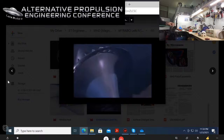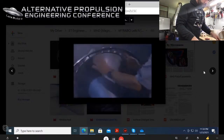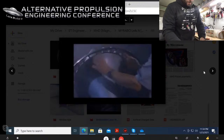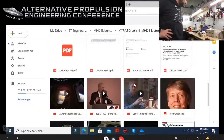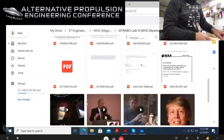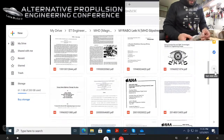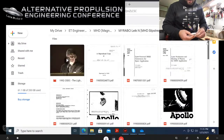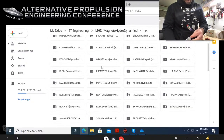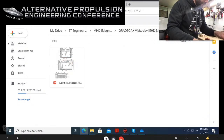Jeremiah, what would you recommend for a spark gap distance? What's your discharge potential? I'd start out at about 1 millimeter, and I'd open it up from there up to about a maximum of 5 millimeters. Okay. Should I also throw in some resistors between the power supply? Between the power supply, yes, definitely. Just in case the rectifier happens to have a problem and it bypasses, at least you have something in there to kind of protect it. I would highly recommend resistors.